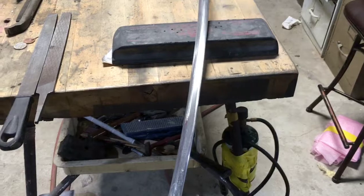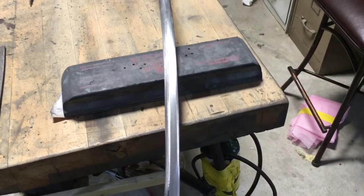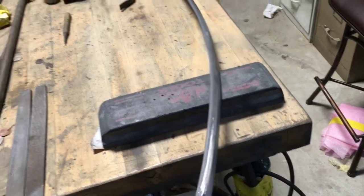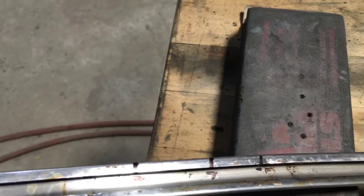So here you can see this is the spot where the dents were in the stainless. I just want to walk back and forth trying to show it to you. Show you where things were marked maybe underneath. Slowly move that over. You see where things were marked, and I had to work out different dents right in through there. You just gotta go through and pin them and dolly them back and forth.